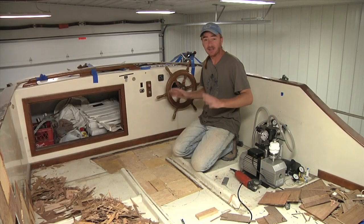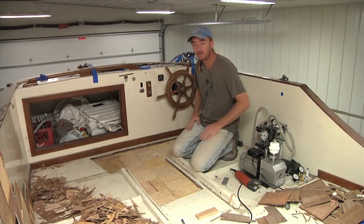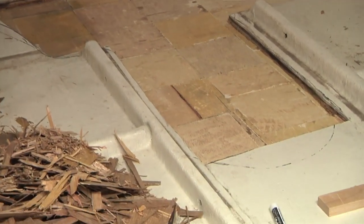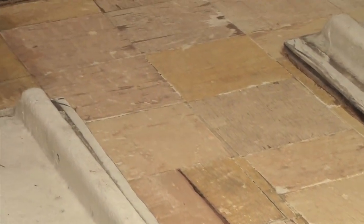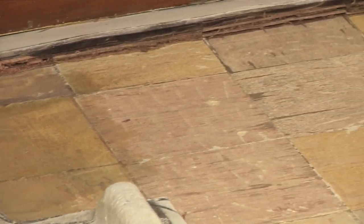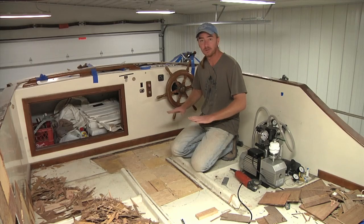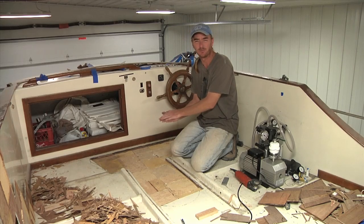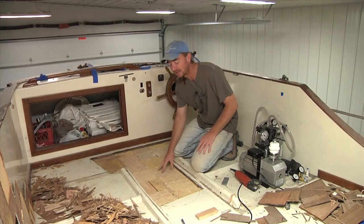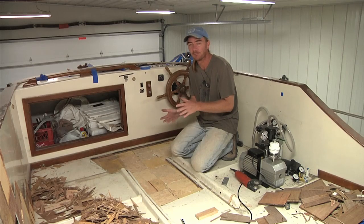I've gotten all the coring material removed. I want to zoom in a bit so you can see how far down we needed to go. The answer is: all the way. You want to make sure you're down to the base layer of fiberglass so that your new material actually has something solid to bond onto. If you left any layer of old plywood, you're only bonding to that piece, and we don't know how well that's bonded to the fiberglass beneath it. The strength of a laminate comes from having a good bond.